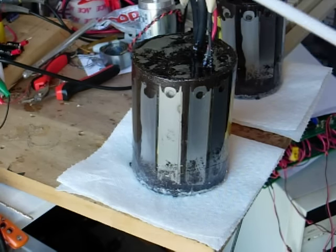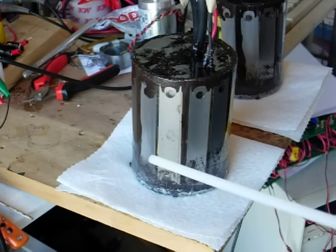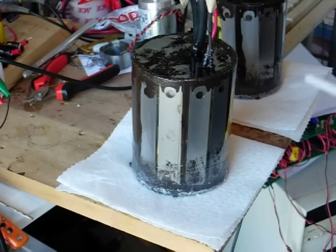This is the low voltage side and this is the high voltage side. One of them is the 22 gauge wire, 400 turns, 2.5 turns copper plate. The other one is the 24 gauge, 400 turns, 2.5 inch copper plate, 2.5 turns — and the copper plate is about 2 inches wide and it's easily bent, so it's probably about a little less than a 32nd of an inch thick.